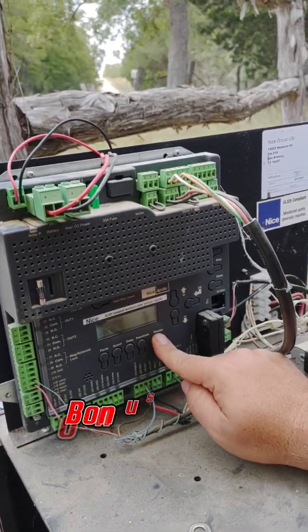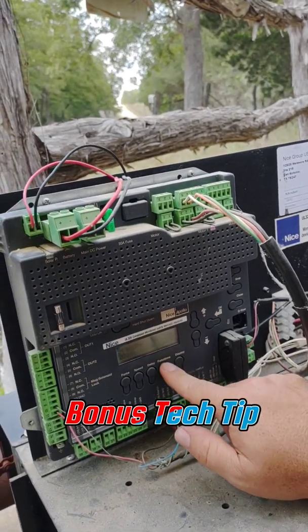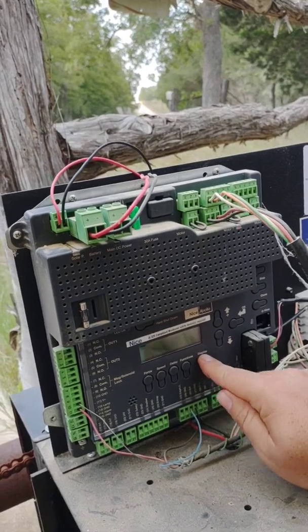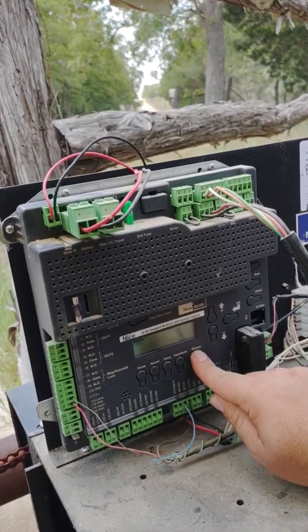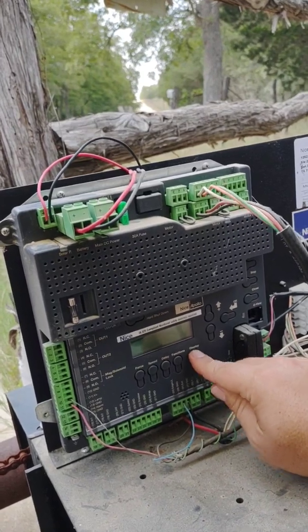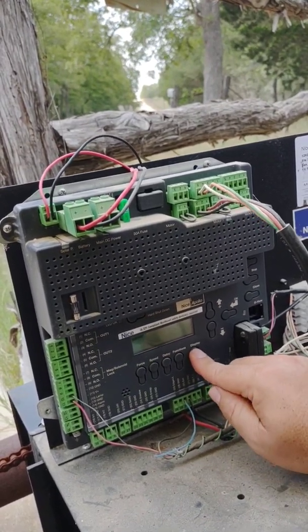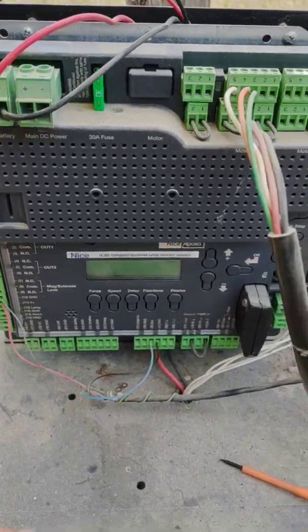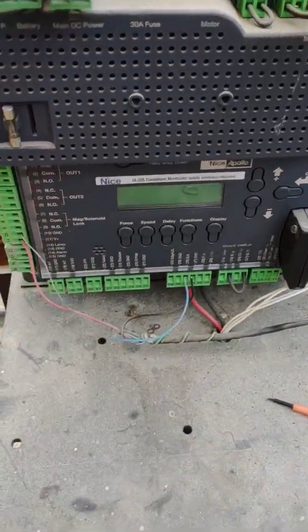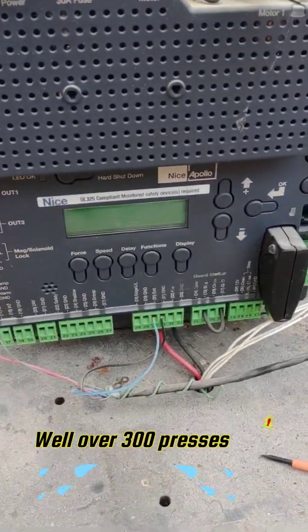Here's another tech tip: on these 1050 boards, the contacts to the buttons can get oxidized over time. Sometimes you'll have to come in and click the button several times to get them to finally function again. If you're patient and keep clicking it, it'll eventually start working. This board proved me wrong — this is the first time I've run into one. We've clicked that display button so many times and haven't been able to get it active again. We give up.